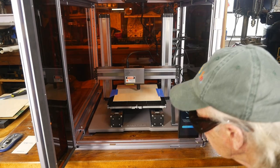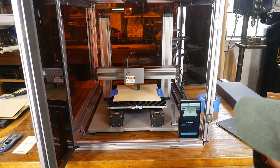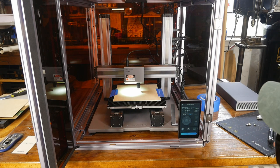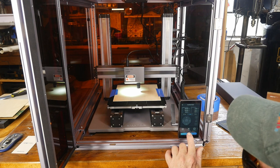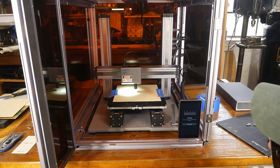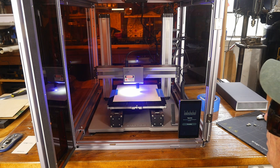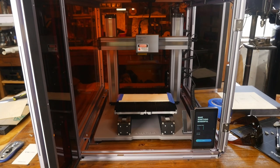Going to autofocus — the machine needs to know where the laser engraving and cutting platform height is. This is now attempt number six setting up the laser focal point. Starting the work origin again with my glasses on. It's engraving calibration lines, and there's a camera in here that will look at those lines and determine the right focal point. The lines go from really sharp to progressively lighter.